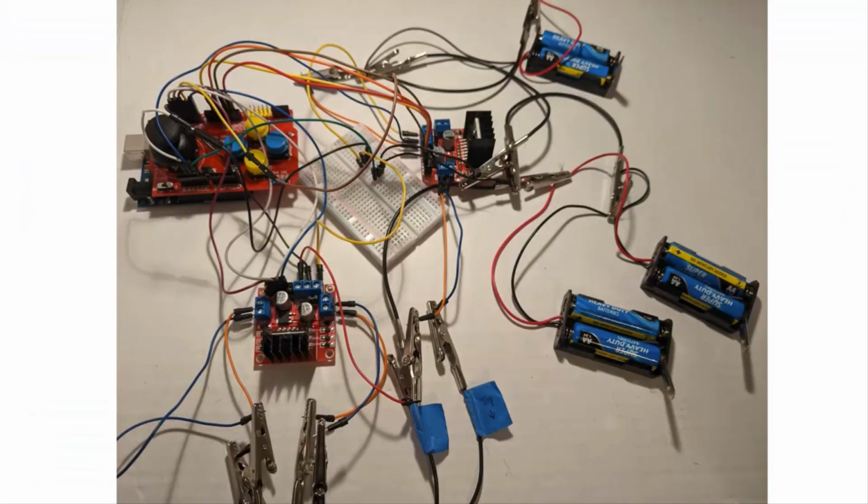In this picture you can see the full setup circuitry with the Arduino with the Funduino on it, the 2 H bridges, the 3 battery packs, and the wires from the ROV connected to everything. As the block diagram stated, the 2 H bridges are connected to the Arduino. The first H bridge is connected to the 2 side motors and the other one's connected to the top motor.